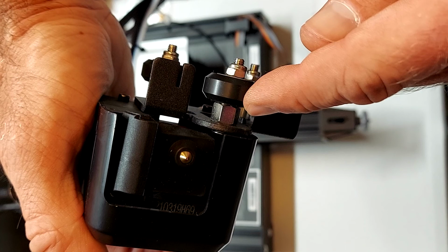The idea is that you want to adjust the carriages so that there is no play, so that the carriage will not wiggle on the extrusion, yet the carriage will still move smoothly on the extrusion. You can do this by adjusting the eccentric nut to tighten or loosen the tension, and you should just barely be able to turn the carriage wheel while holding the carriage still, so that there's just enough slip that you can turn the carriage wheel. You must adjust all axes carriage wheels.